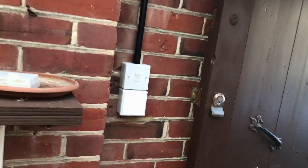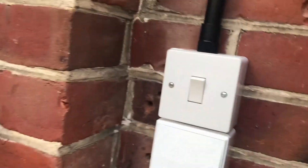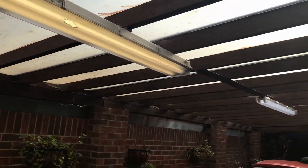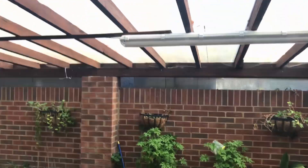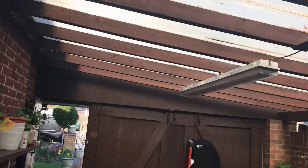We end up with our Kinetic switches, which I've mounted onto a plate — and as you see the lights come on. Then we can go into the kitchen area where we have a second switch which has just been stuck to the tiles using a sticky pad, so no untidy wiring or messing around. And as you see, we switch this one and the lights are off — so there we have our two-way switching, on and off from both switches.